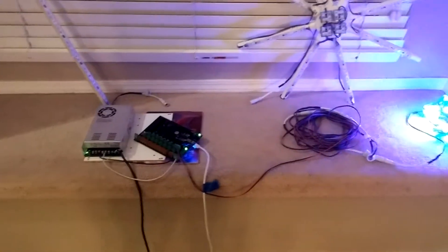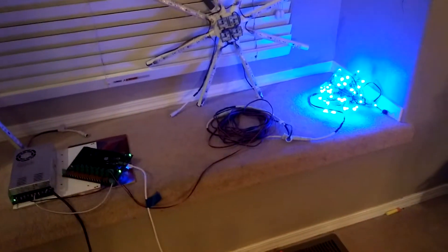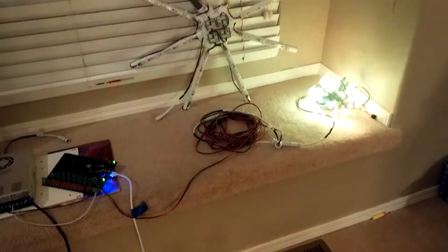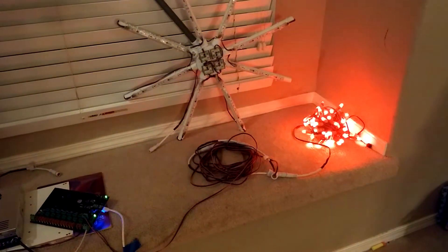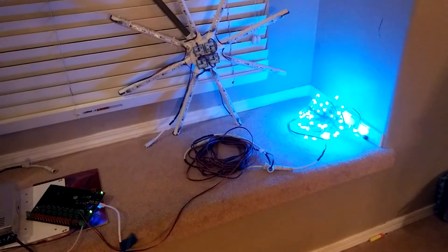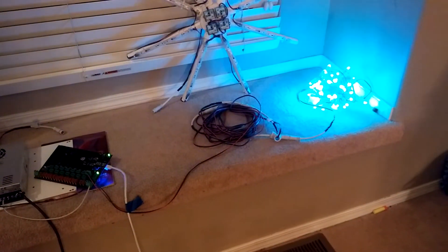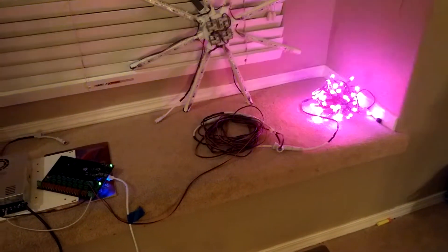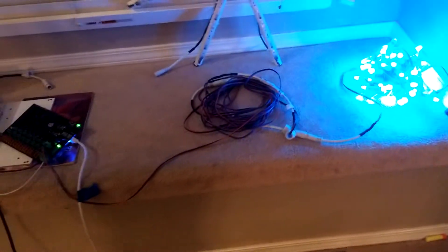On this test, I ran 1804 pixel nodes, and it didn't go as far as the strips did. It seemed like I got about 40-something feet before it started having problems, and the data was a little jumbled. You can see I have about 40-something feet — I think it's two cables that equal about 40 feet or so.